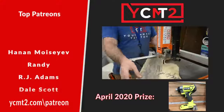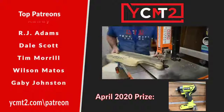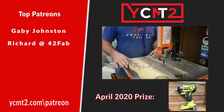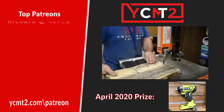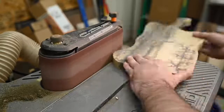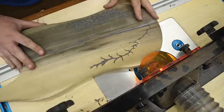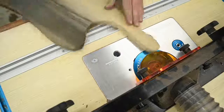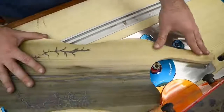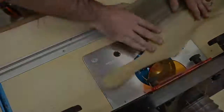Before sanding, I need to get the poplar boards ready too. I finalize the shape I want them to be. I often see people cutting these out with jigsaws and coping saws, so I thought I'd show that a band saw also works — even if you only have a resaw blade — it just takes a little finagling around the corners and some relief cuts. Whichever saw I use tends to leave a rough cut, but my oscillating sander makes quick work of smoothing them out and is a lot faster than hand sanding. A chamfer didn't feel right on these curvy boards, so I opted to break the edges on both sides with a round-over bit instead.